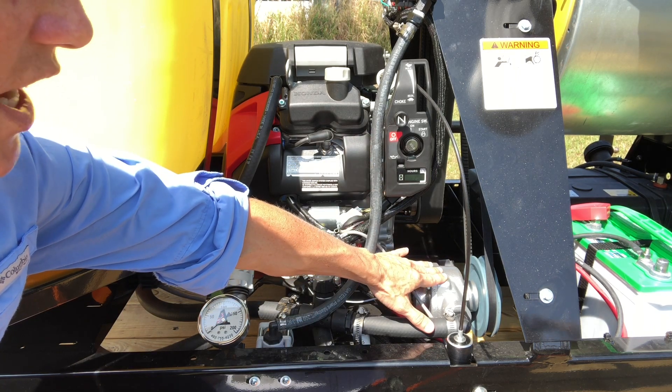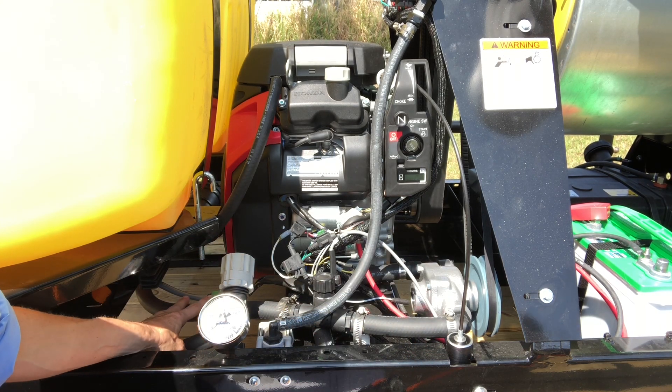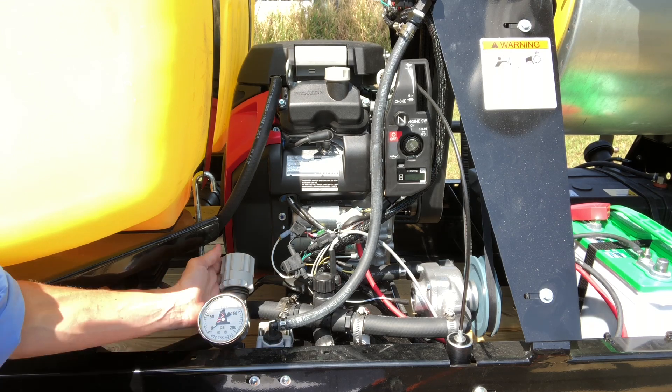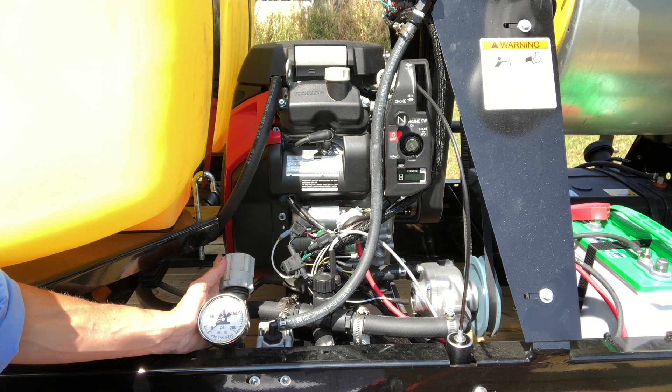This is your water pump located down here. It's a Hy-Pro 6 roller, and all of the plumbing that goes into the water tank goes this direction. Here you have the pressure gauge and relief valve area. We'll be talking in more detail about this because this is the area where we will adjust flow and pressure later on in our calibration techniques.